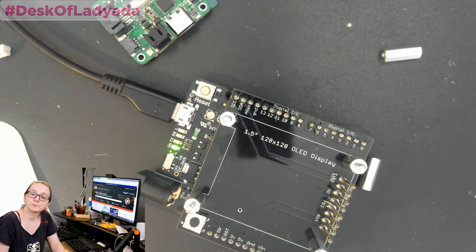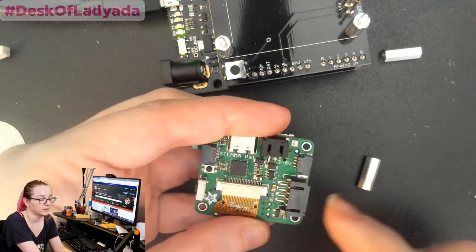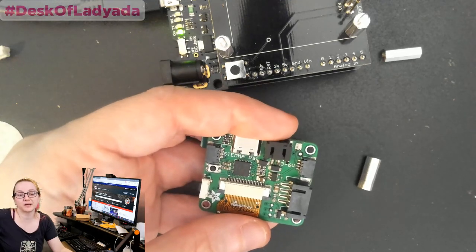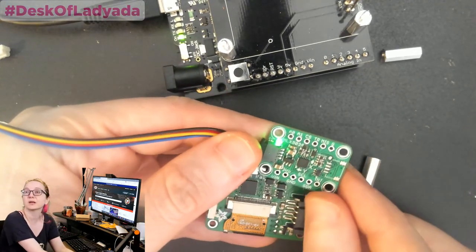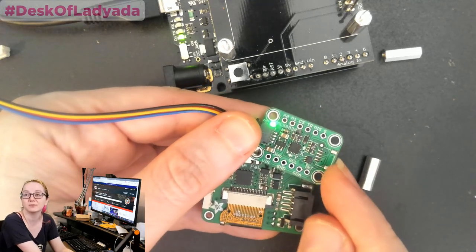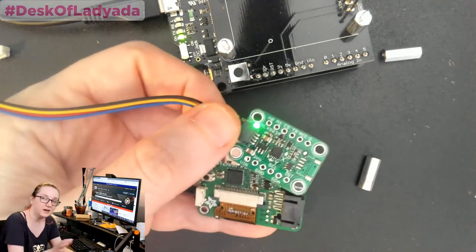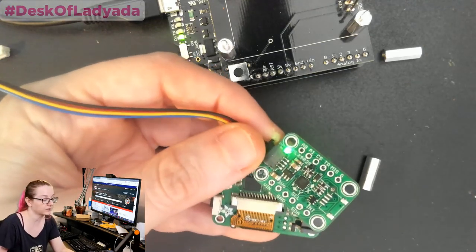Shout out to Valadir in Vietnam. Is it difficult to have products that support both Stemma and Stemma QT? The Stemma originally was going to be the JST 4-pin larger connector, and I did a couple of boards with that. But the connector is so large that on my little sensor breakouts it's just massive. When SparkFun started making boards with the one-millimeter pitch connector, I wasn't sure — 'Oh, it's such a small connector, is it going to break?' But I actually tried it and was like, this is a really good connector. They're JSTSH.